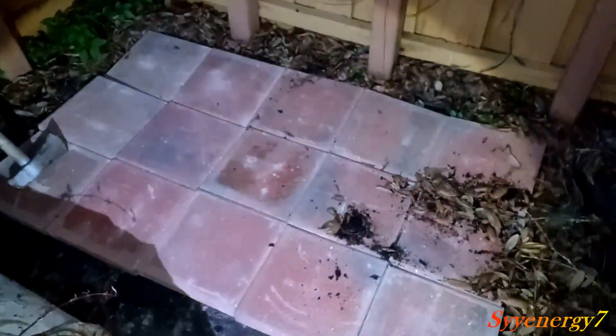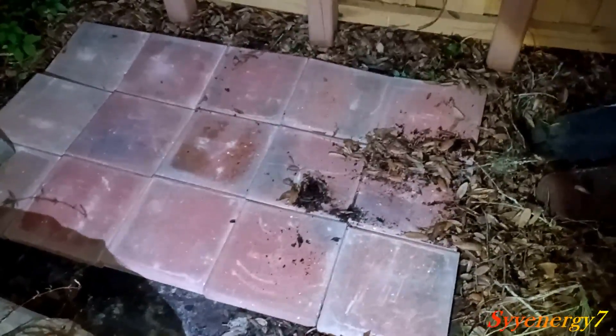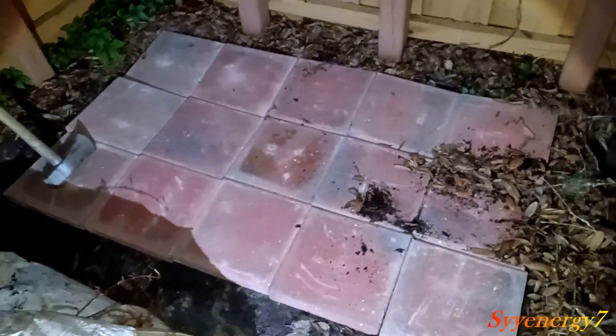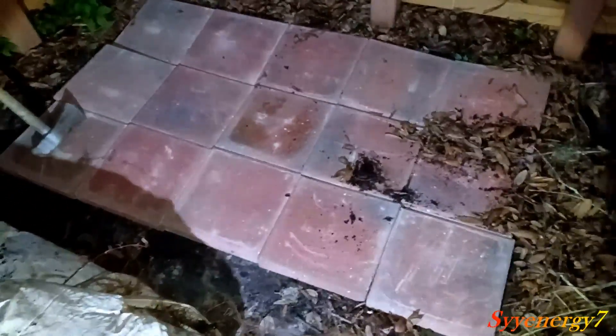This is all walled in — you got one wall here, one there, one there, then going around this side. It's going to be fine because you have tie downs anyway, so you just lay them down. This is smooth over here because I had a tarp underneath this. I'll probably just put it down and adjust — this is a lightweight shed, you can always adjust the blocks by digging out from underneath them individually and putting some sand underneath if they're too low.